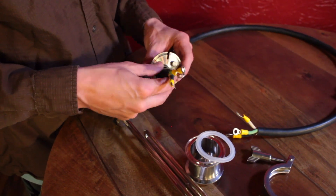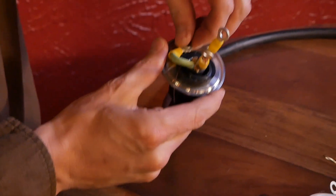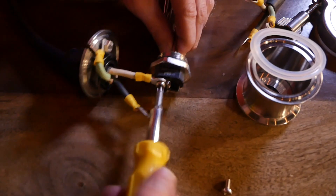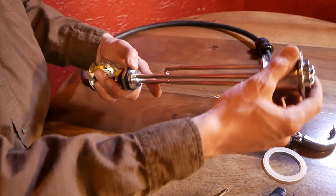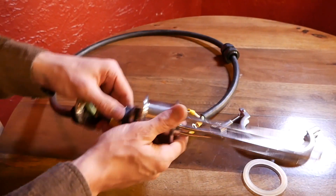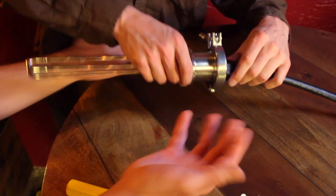Attach the plate for your element guard kit. Tightly secure the cable gland and attach the green wire to the grounding screw on the plate. Attach wire terminals to the heating element and slide the tube portion of the element guard and its gasket over the element. You may need a buddy to help hold the pieces together while you clamp them.